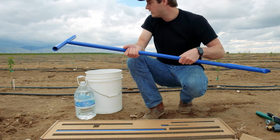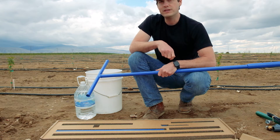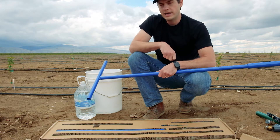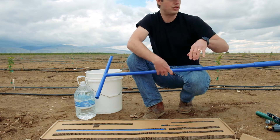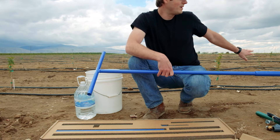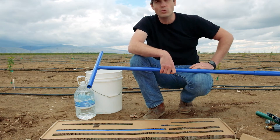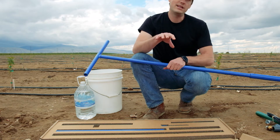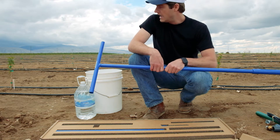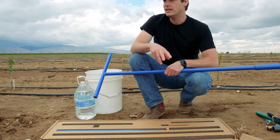That's your auger. Now you're going to want to find a representative plant somewhere in your field. You can run the cable — 500 feet is the max length but that's not very practical. Normally what guys do is trench one or two rows over and pick a plant that's not in a super deep spot where water might pool — just something real average. Then you want to find a spot on the southwest side of that plant, because in the northern hemisphere that gets the most sun exposure.